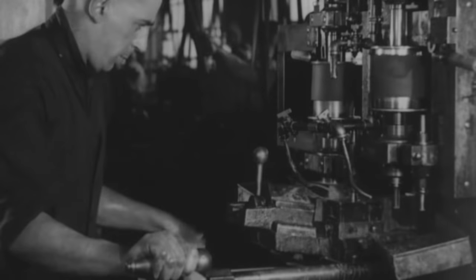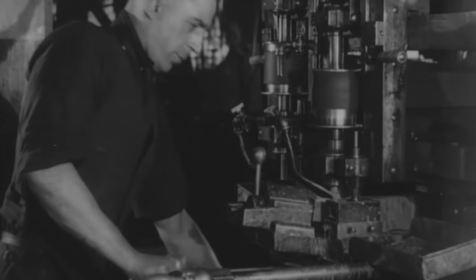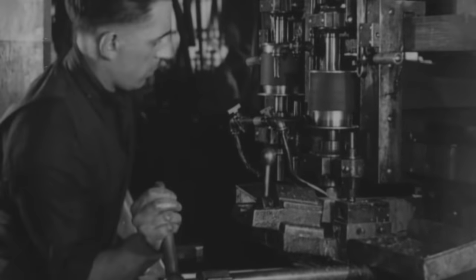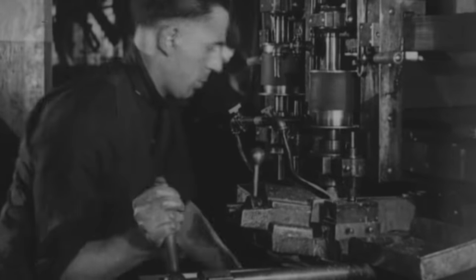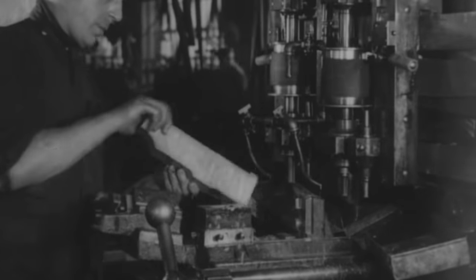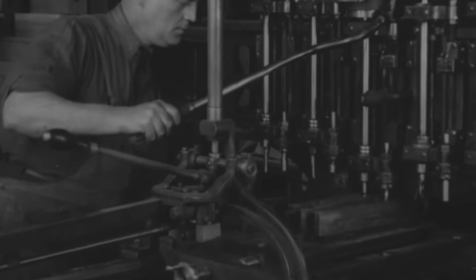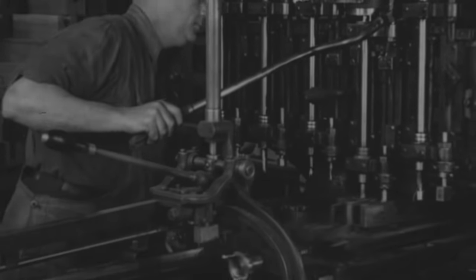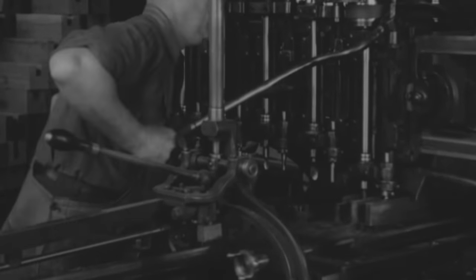So what's interesting from a production engineering perspective here is that the dude is literally just the muscle to move it. Yeah, it's actually kind of... You're right, he guides it into the jig and aligns it, and then realistically, if you had enough motor laying around, you wouldn't really need them to do anything other than that. No, because these dudes were just operating the machines. They weren't setting the machines. There'd be a tool setter who would be paid more and would go around and set them up. Once the stops would get out of line and things started coming off not passing the gauge, the tool setter would come along and reset the machines. But basically, someone set the stops, and all he has to do is a specific series of movements up towards the stops, and that's all he does all day.